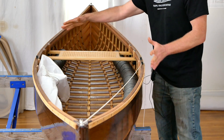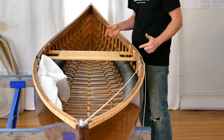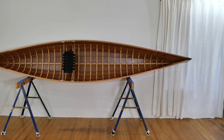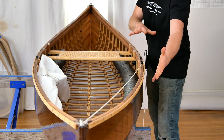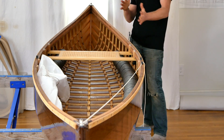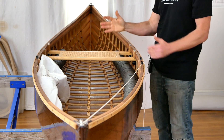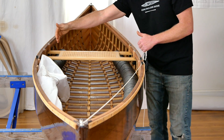Starting with the deck shape in plan view, what I've been doing for the last couple of years is building my solo canoes asymmetrically — the widest point of the boat is about five inches aft of center, which pushes more volume into the back of the boat. My experience as a kayak designer tells me that's going to be a more efficient hull shape and also make the boat more controllable in challenging wind and wave conditions, especially when conditions are coming from the stern quarter. But the kayak asymmetry is dramatic, and what I've been doing on the canoes is actually pretty subtle.